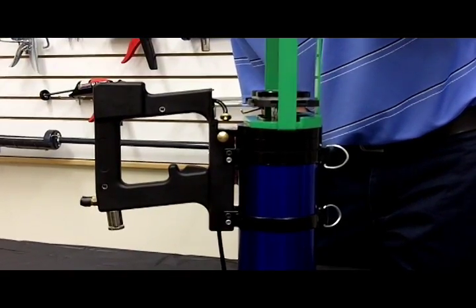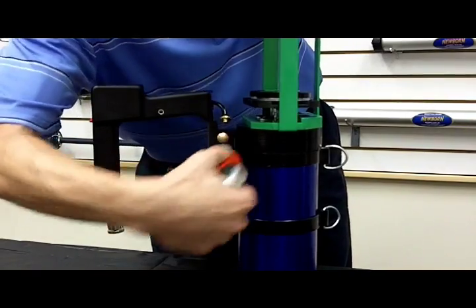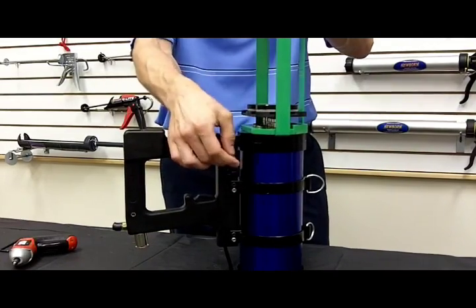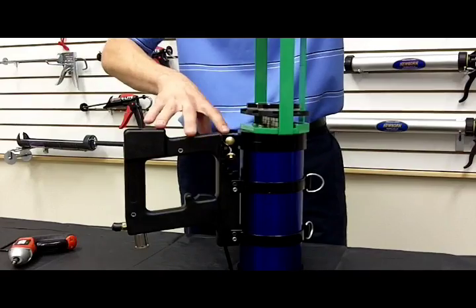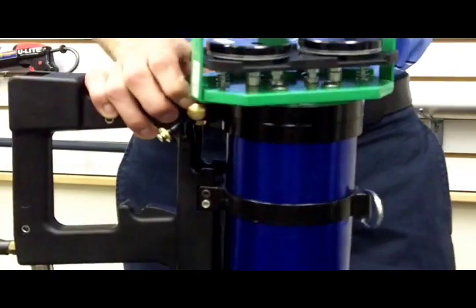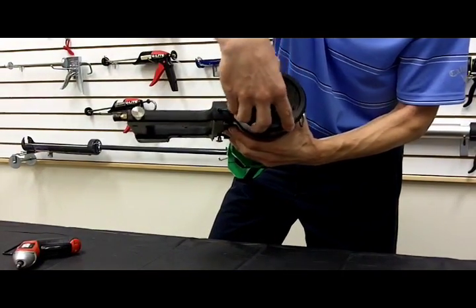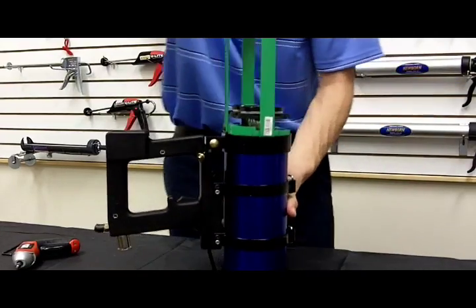Just enough, and you'll see why you just loosen it enough. And now I just simply slide this collar system down. Keep an eye on your air hose, and then you rotate the forward reverse switch and this combo trigger system together. And the reason that you can do that is because of the way we designed our valves in the front and back. The seals remain intact, but you can rotate these. It's a very, very innovative design.